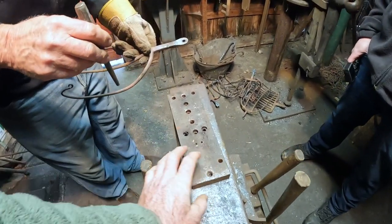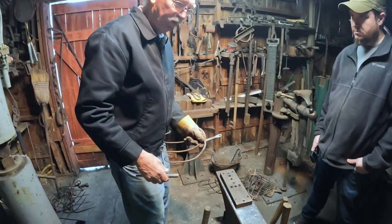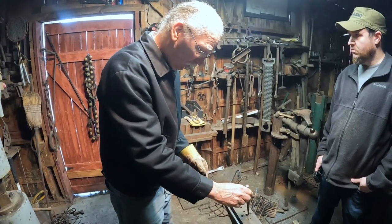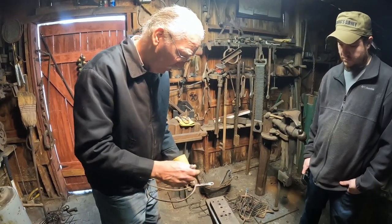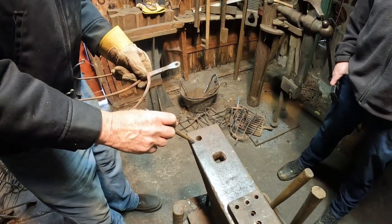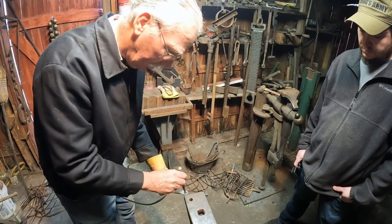Now, would this be a traditional piece a blacksmith would have, say, 200 years ago? Sure. There were all kinds of nail headers and tools that looked the same with holes like this in. You might create a shoulder on a bolt or a nail or punch a hole. That's what these holes are for. This hole is for an anvil. It's called a Pritchel hole. I don't know where the name came from, but you lay your piece on that hole and then punch it. And punch through.